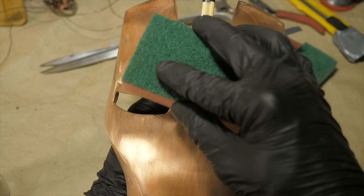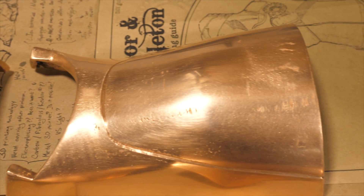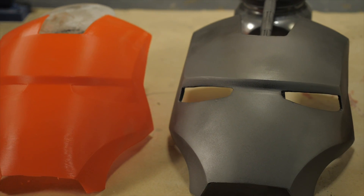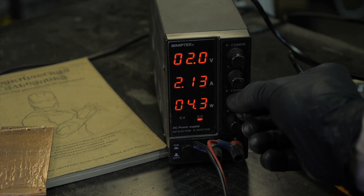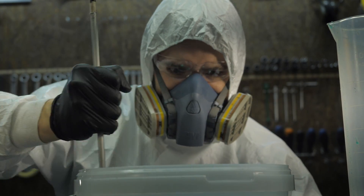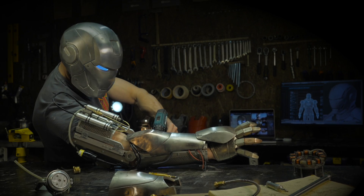To give the best protective properties and protection against oxidation, a layer of copper is usually plated with nickel and then chromium. But you must admit that even without nickel and chrome, our pot looks impressive — and it's not just decorative. The main thing is the combination of weight, strength, and hardness of such a material, and the ease of the manufacturing technology. If this video was helpful, click like, share it with your friends, and subscribe to the channel not to miss the next video, in which we cover the pot with a layer of nickel for even more perfect properties. Good luck with your own projects and see you soon!